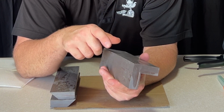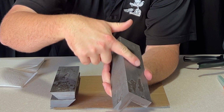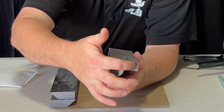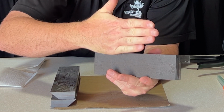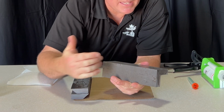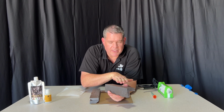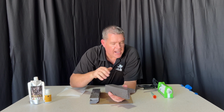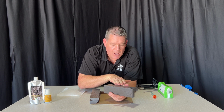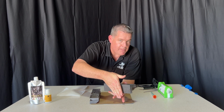But the reason you do a miter edge, particularly with porcelain materials, is because this top color is not the same color as the through body. So you're doing a miter edge so that it wraps down, comes across the top and wraps down the edge. You might do a miter edge on quartz or natural stone because you want the veining to come across that edge and wrap down. For instance, on a waterfall island, you are putting 45s on those drop legs so that any veining or any direction in that material is going to come down across the top and wrap down that